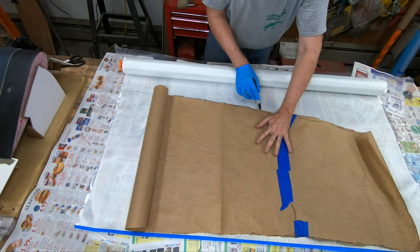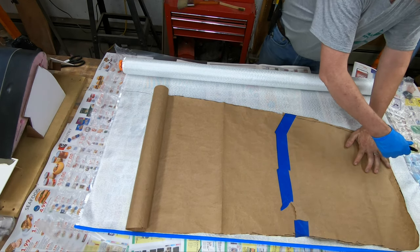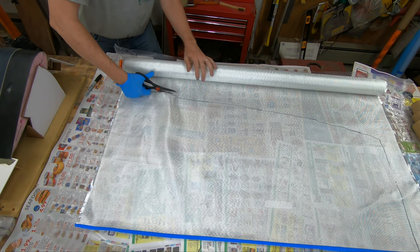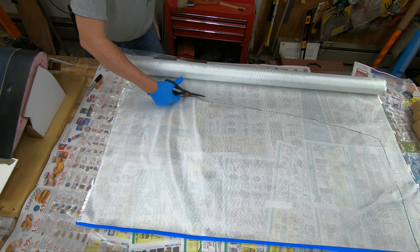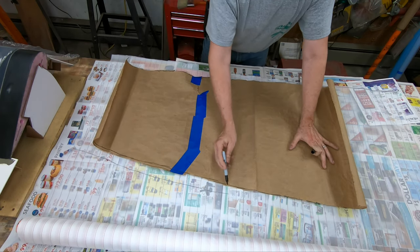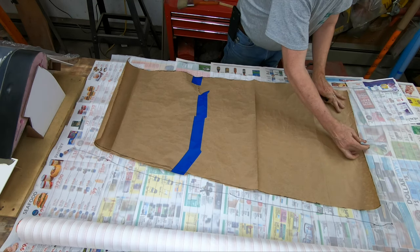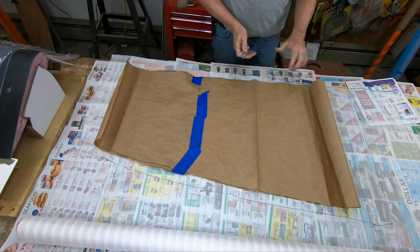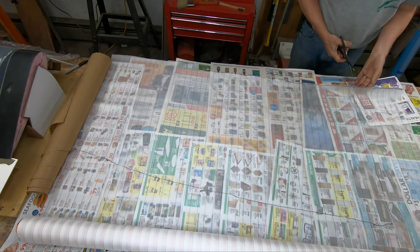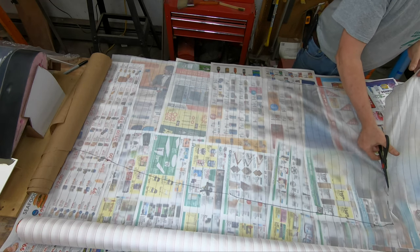With my template I laid it down on top of the 320 gram per square meter cloth to use for the mold surface — four layers of this fiberglass cloth. I was guessing at how many I needed; I now think I should have done more, probably six layers at least, to get the rigidity I want for this size of mold. I then cut it out four times. Since I'm going to be laying up rib stiffeners and a stand on top of the outside mold surface, I need to mechanically bond fiberglass tabbing to it, so I cut peel ply just a little bit larger than the fiberglass — that'll keep little fibers from sticking up and poking me after curing and give a rough bondable surface.